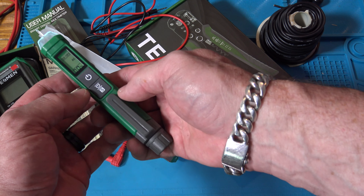Look at the user manual on the wire stripper — it covers multiple languages. Here's the wire stripper itself: wire cutter up top, the blade, and an insulation crimper for red, blue, and yellow insulated connectors. Down below are the uninsulated sizes: 12 to 10 gauge (4–6mm), 16 to 14 gauge (1.5–2.5mm), and 22 to 16 gauge (0.5–1mm).